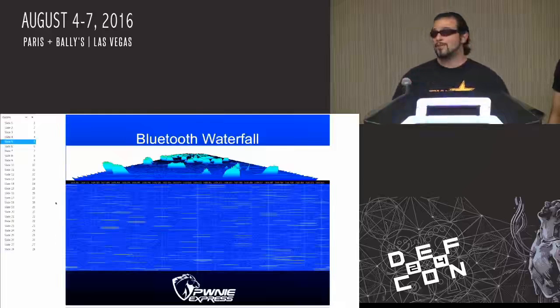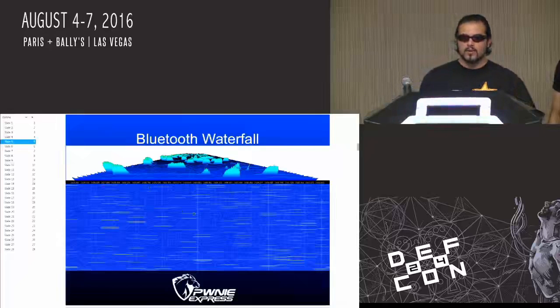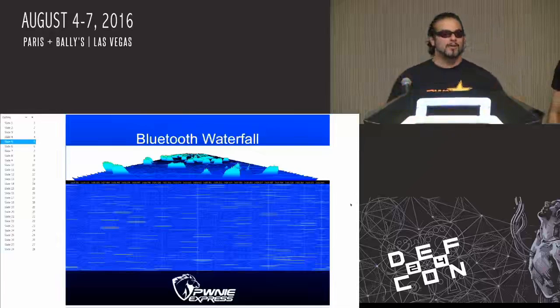This is high bandwidth audio. This is very high quality. As you can see, very, very little actual data is being sent. On a network where you would have a large Wi-Fi network possibly right in the middle of this, you'd actually see all the Bluetooth go below and above using what's called adaptive frequency hopping. It's basically just going to avoid interfering with the Wi-Fi and avoid being interfered with by the Wi-Fi.